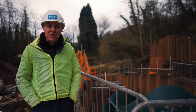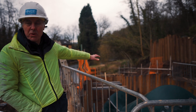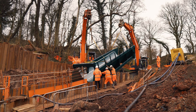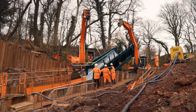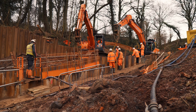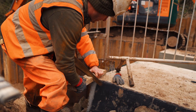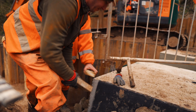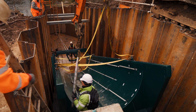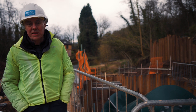The final part of that exercise was to get the trough delicately positioned onto the correct foundation points in the civil structure. Whoever built the weir built a wall that went all the way up to the top, and when we started building this, it was right in the way. So instead of the water coming out the end of the screw, it's now going to come out the side. The dimensions of the civil structure had to be absolutely spot on within about 5 millimetres, and the angle at which the whole trough had to be installed had to be accurate within half a degree.